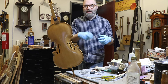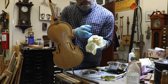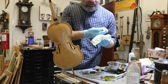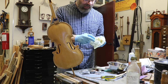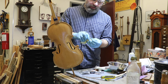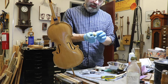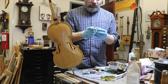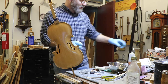But I want to show you one bodying session of French polish. And what it is, and you'll see my head cut out here in a second, it is a wad of cheesecloth or linen. And it has inside of it denatured alcohol and purified shellac, a super blonde shellac that I actually grind up and make my own. And then I wrap that, what they call a rubber, that little wadding, in a different outer fabric. And that makes our real rubber. It is a cloth pad, and I can hold it and squeeze it and get a little bit of shellac out. So I've loaded that up with some shellac and denatured alcohol.